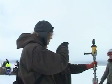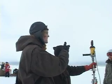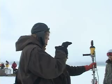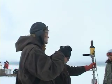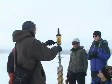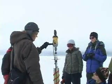The other issue, of course, is this is a very powerful drill, and so you want to be very careful that you always hold the drill. This thing is almost like a shotgun, right? You never put your finger on the trigger unless you're sure that you want to drill. And when you start drilling, you want to make sure that you have the drill very firmly and securely in both of your hands. One of the common mistakes is that people hold this loosely, and they're looking at this here and they come up and hit this thing accidentally while they're loosely holding the drill. The drill starts to spin and you can sprain or even break your wrist.